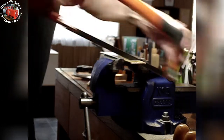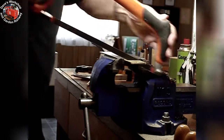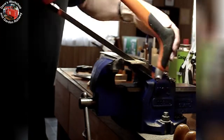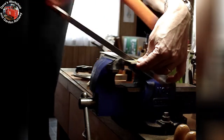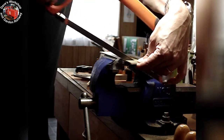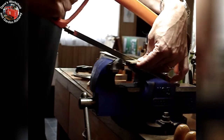Here's an action shot of me doing some more cutting. This is the newly arrived wider brass flat for the cylinder port faces — it's one and a half inches wide (38mm), as opposed to the one and a quarter inch wide (32mm) flat that the top covers are made from. This brass felt hard through the saw blade; hopefully it will be long wearing against the slide valve. I cut two pieces a little over length to allow for milling to size, but before that they will be thicknessed.